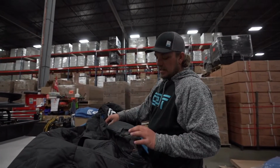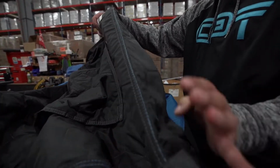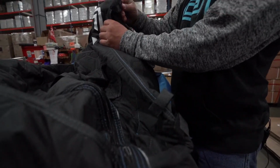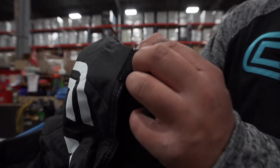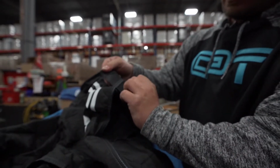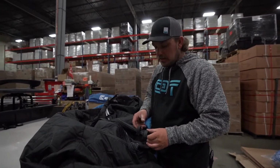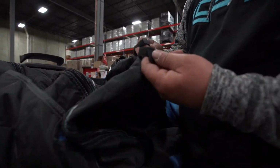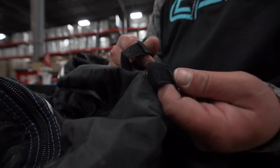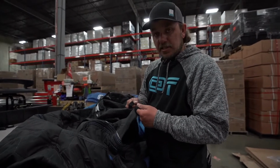And then the next thing I'm going to look for is these. You've got a bunch of Velcro, but all of them are one big single piece, okay? So very easy to identify that. And the center of the rear is going to have two slimmer pieces close to each other, about an inch and a half apart. And that's going to dictate that that is the rear center of the house.